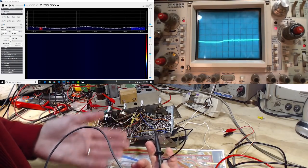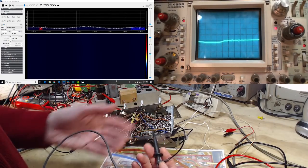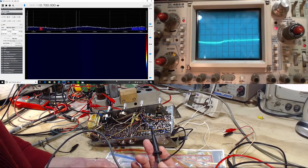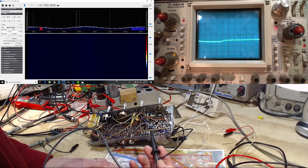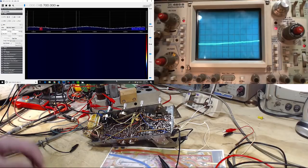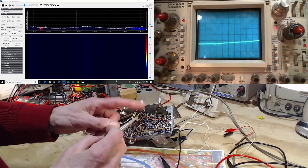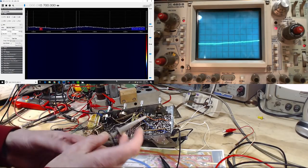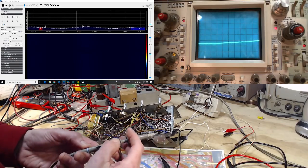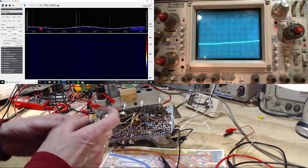So, it's easy for me to believe that the signal on the collector is the signal that's needed to go out the IF. So there should be a 10.7 component in that. In order to see the 10.7 component, let me switch over to the SDR. Just to protect things, if I put this on times 10, well, it's weakened it quite a bit, but let's give it a try.